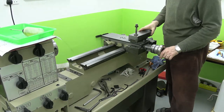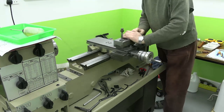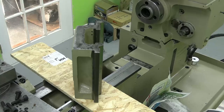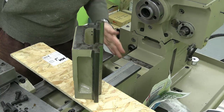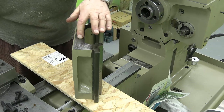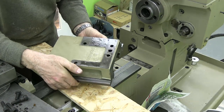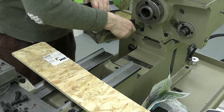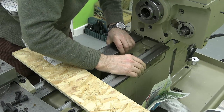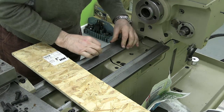I cleaned up and cold blued those various bits of the saddle that I had difficulty getting undone, so hopefully that won't happen again. When I put the saddle and the cross slide and the top slide on, what I'm going to do now is put the gap bed back in. All the surfaces are clean — it's got a light coating of oil. This might not look very clean but I've resisted abrading it because that's the mating surface. So it goes in like that.